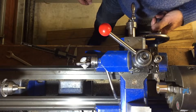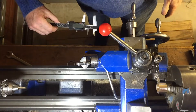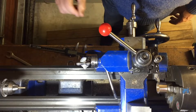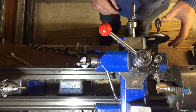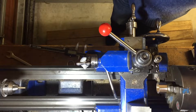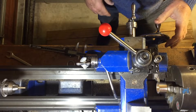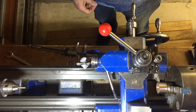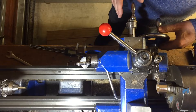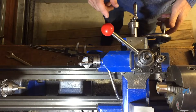What I might have done in the past is advance to within about 0.02 of the desired dimension and then do a light skimming cut to finish off and get the final dimension. But Terry tells me I should totally avoid that — avoid fine cuts like the plague, he says. Instead, you do two larger cuts. I'm going in 0.22 total, so perhaps 0.11 with each cut.